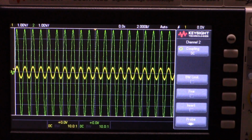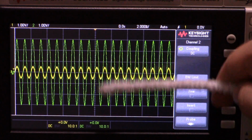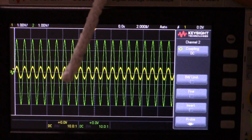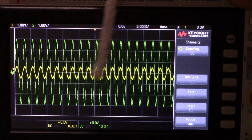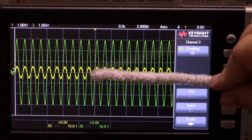So I can change my at maximum volume. This is at maximum volume, so I turn my output parallel resistor down until I get the 6 volts peak to peak swing I want. And now if I change the volume knob, I get the correct maximum voltage swing. And then you just power amplify this and put it across your speaker. And that's the output voltage that you want to put across. So you have your peak to peak output voltage, and then the impedance of your speaker determines the watts that go across it. That sort of thing. But that is an OTA in simple voltage amplification mode.